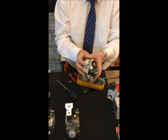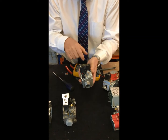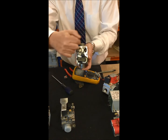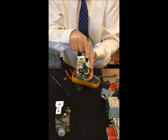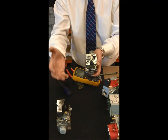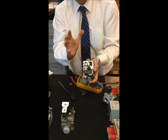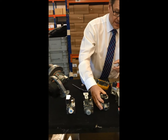Now we're into pre-mix boilers. This is Honeywell, and this Honeywell valve is driven DC voltage. Here we have the throttle - we're setting this at 9% CO2 percentage. It's a click mechanism where each click is half a percent CO2. Use an Allen key to alter your CO2 percentage there. Here is the offset - you don't have to set the low on our appliances as it's already preset. But on other boilers they may ask you to use the offset to set the low. Be very careful when tampering with offsets, because if you knock it out of line all sorts of things can go wrong.